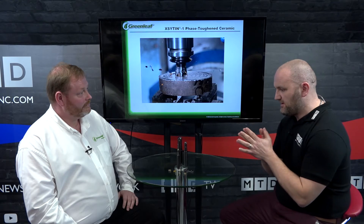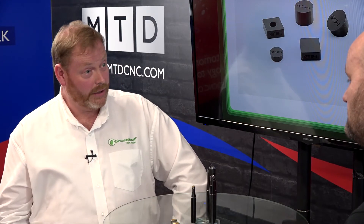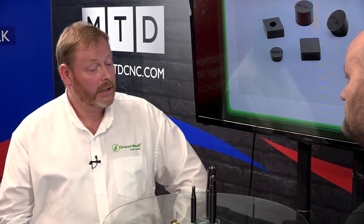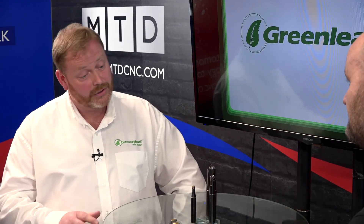Finally, what is the big advantage to ceramics for a mold shop — and this isn't exclusively for mold and die — why would I use Greenleaf? Greenleaf offers a full range from 10mm up to 25mm in diameter, and also an imperial range. The inserts fit directly into the toolholder whether it's a ceramic or carbide insert, so your tooling costs come down, and there's a nice crossover working from softer materials up into the harder materials depending on your application.